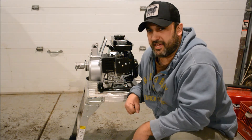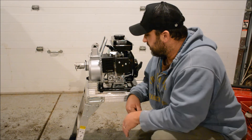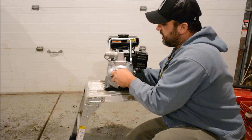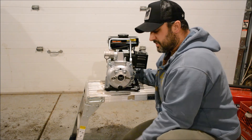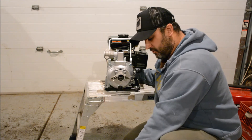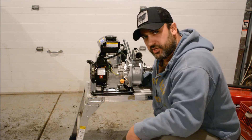The tower is only about eight to ten feet off the ground. This pump is rated to pump up to — I believe it's 85 feet high out of the exhaust. And I believe it'll suck from the intake from a lower position — if you're sucking from down below, I think it's about 20 feet. But correct me if I'm wrong. Anyways, let's give it a shot.